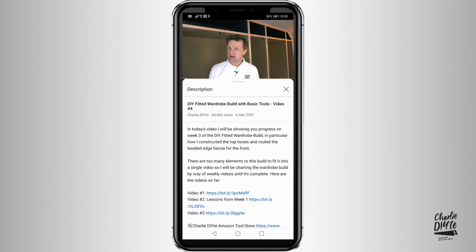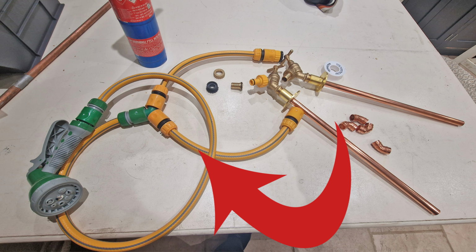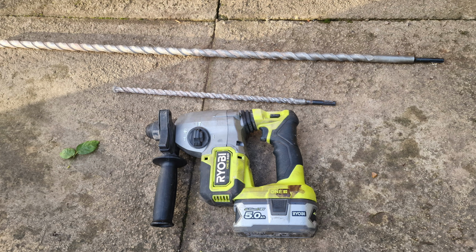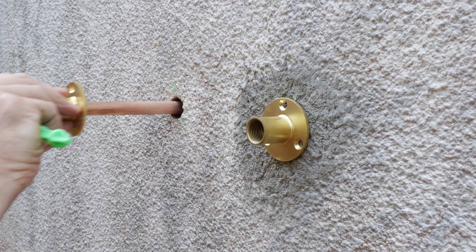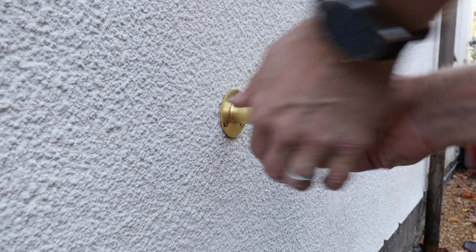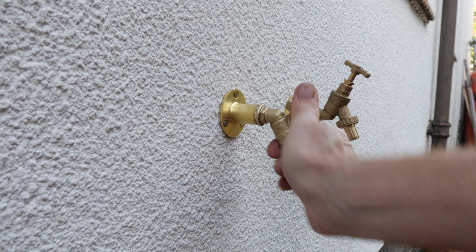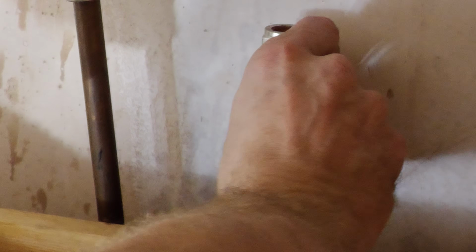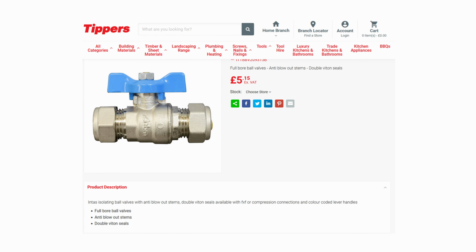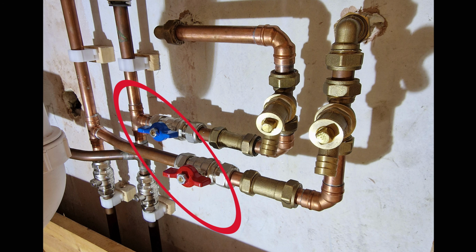So let's have a quick look at today's toolkit, and you'll find links to everything in the description below this video. We've got the outdoor tap hose temperature mixer, SDS drill with 16 and 24mm diameter drill bits, 2 brass wall plates with 15mm copper tails, 2 brass bib taps. I bought double check valve taps but ended up using standard ones for reasons I'll explain, but the double check ones won't go to waste. 2 15mm full bore isolating valves to replace the old valves, and 2 additional ones with butterfly handles to isolate the water to the new taps.